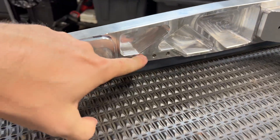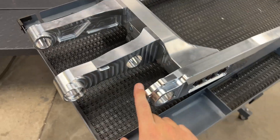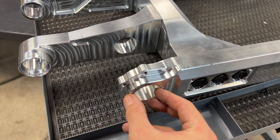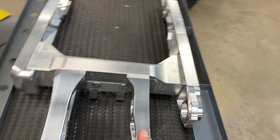We've also added some provisions for a chain guard up front. The way we have this designed, we actually simplified the chain adjustment. There used to be a knob on our old swing arm where you would take the adjuster out and rotate it — now you can simply just take the bolts out on each side and do your jackshaft adjustments.